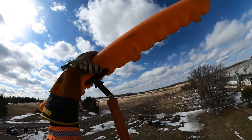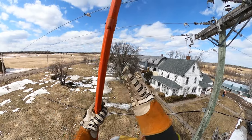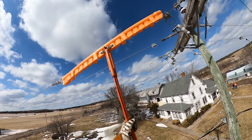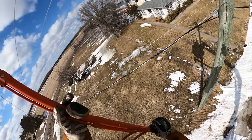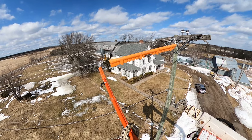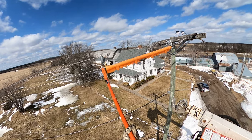This piece of hard cover-up is rated for 46,000 volts — in ideal conditions when it's clean. This is only number two ACSR so it should slide on pretty easily, but if it was bigger wire like 556 you'd want to apply a downward pressure as you slide it. I've got my tap clamp a little bit close so I don't have a lot of room, but it does pop into place easily on number two ACSR. If it were bigger wire I'd have slid it into place first from about six feet away from the structure and then put the tap clamp in place. The sag was quite low here so I was worried about it sliding outside my work area — just loosening that tap clamp and snugging it tighter to keep the hard cover-up close to the work area.